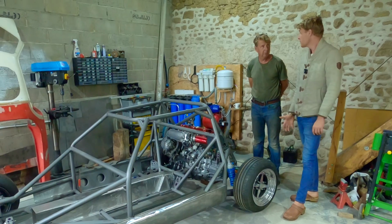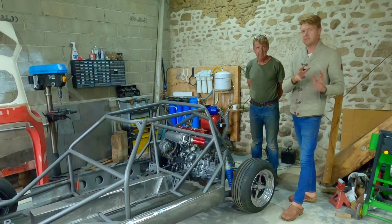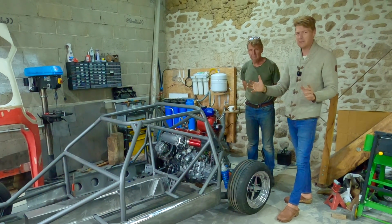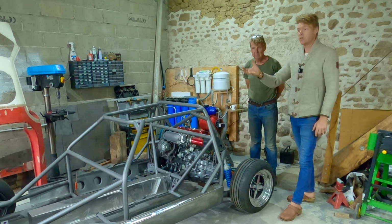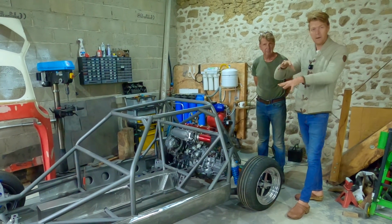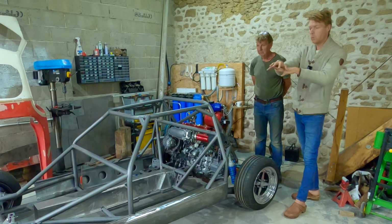A lot of people keep asking me what the weight balance is going to be. Yeah, the front to rear split. Yeah, and we can adjust it slightly by moving things like the windscreen washer bottle, which I know sounds silly, but it holds nearly a litre of water. So that's a kilo. The battery, which will be a super lightweight one, we can move things like that about in the car to get the weight either more forward or more rearward.